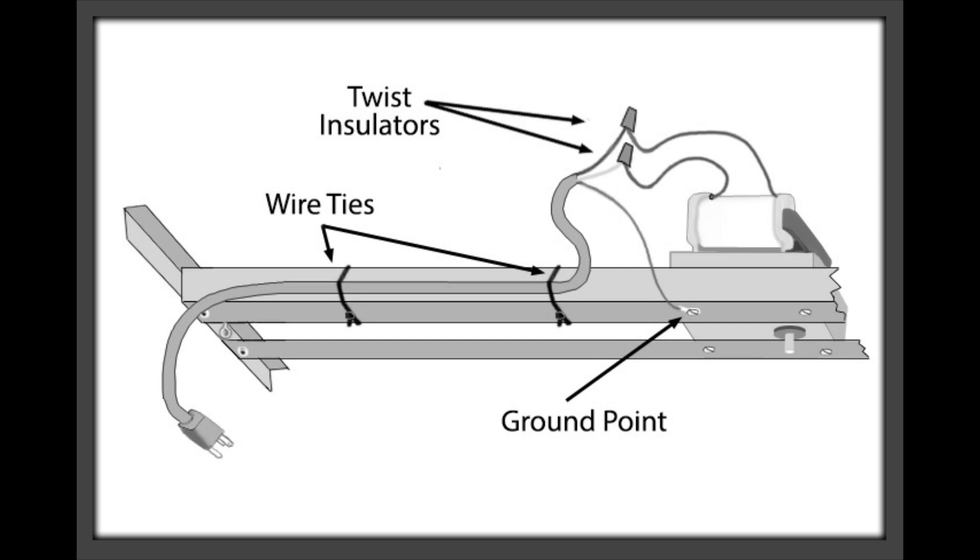Make sure to attach the ground wire, which is usually green, somewhere on the frame. One of the motor mount bolts will work for this, but make sure the connection does not interfere with the travel of the crank. The motor is double insulated as the coil on the field assembly is made of insulating plastic. There is almost no possibility of shock as long as you securely connect the wires of the motor to the cord. You can use twist insulators, but if you do, make sure to tape the assembly so that it is secure. Also, it is a good idea to strap the cord to the frame with wire ties and lead it to exit at the rear of the mechanism. Once again, do not block the crank race.